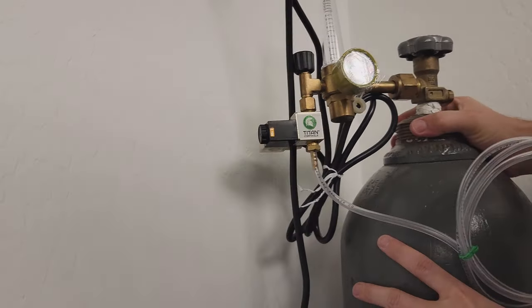You're going to see your pressure go up — we're at about 1000 psi, you can see the gauge. Yours should be around 1000; if it's at 500 you might want to ask the shop what's going on. Go ahead and give the valve a few cranks to get it nice and open. Then grab your soapy water and check all the joining spaces — you may hear a hiss depending on how loud your room is. Put soap around anywhere it joins. If you hear a hiss, it might be leaking — tighten a little bit. We seem to be good right now.